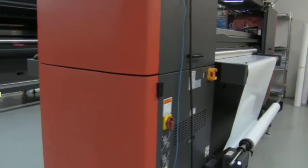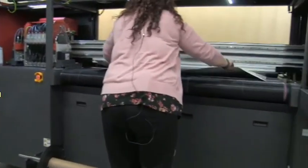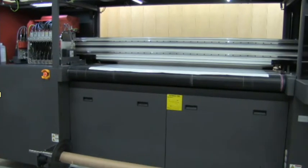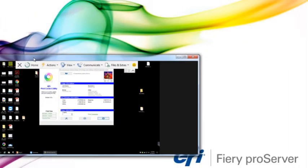One of the key features of running roll-to-roll work on a hybrid is that you don't have to do any measurements for location of the unwind roll to the take-up roll. Running roll-to-roll work on a true hybrid platform such as the EFI Pro 16H, you're able to get your rolled substrate into the print zone, do a media scan and a set gap, and start printing right away. With the pause feature enabled in the EFI Print Control Utility, once you've printed enough substrate to attach to your take-up winder, you can pause, attach, and then resume. With every roll-to-roll job on a hybrid, you're saving three to five feet of material at the front and end of your roll because you can print immediately once you get into the print zone.